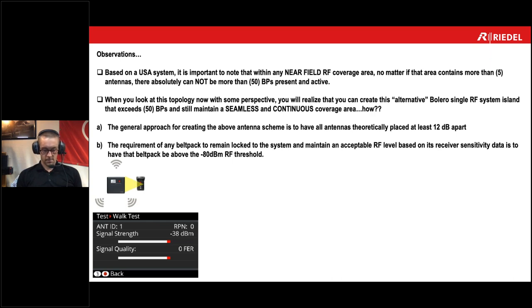Right. Are there polar plots available for the antennas themselves? I can dig some up. Yeah, that'd be great. I've always assumed that it's low out the bottom and pretty much equal in every other direction. Yeah, it's not far off from a donut. Although it's vertical linear polarized, not circular polarized, it does kind of emit off of the antenna body like a donut, or more like a croissant, again, because the rear lobe is lower than the front. Cardioid.